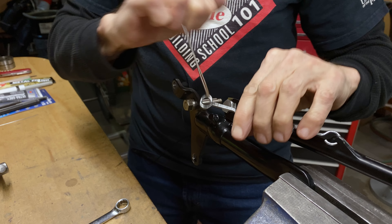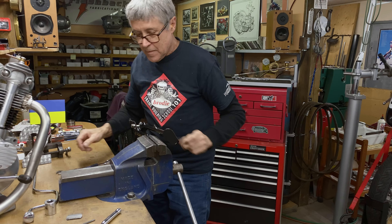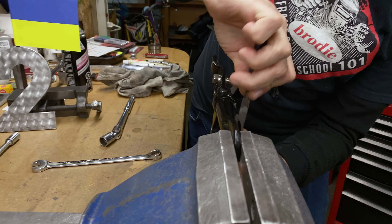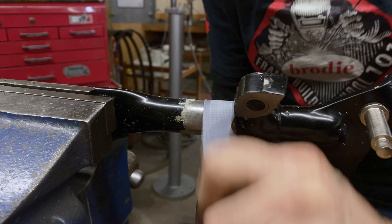Here's a special tool that I made — I've had this for years now. Just welding rod, and I made the end round, and you put a piece of metal in there. That's really good when you want to pull off a spring like this. There we go. That's a good little tool. I'm going to take off the paint because that's going to get hacksawed. There goes a nice coat of paint.